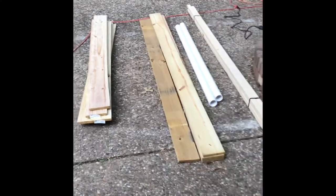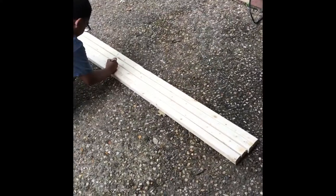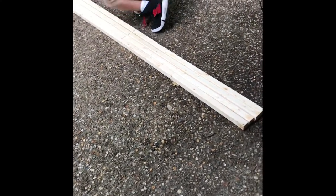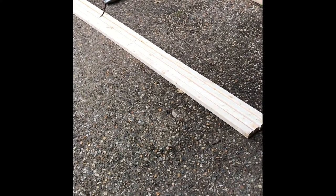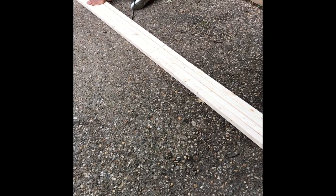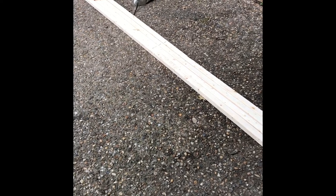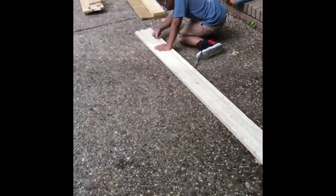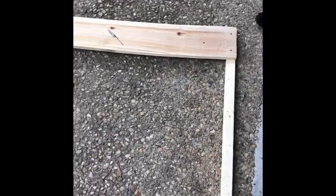My enclosure from the front is going to be eight by three, and from the two sides six by three. Our height is three feet — 36 inches — plus another six inches that will be buried in the ground. JR has taken the time to measure that out to 42 inches on the post and carried the line all the way through on the remaining posts. We'll take the saw, cut these down, and then put everything together.